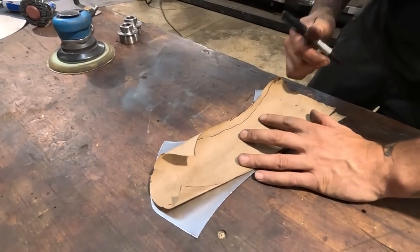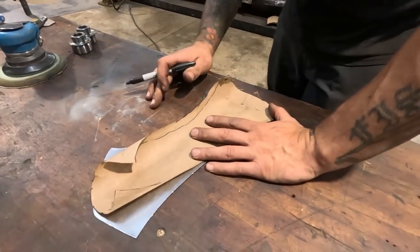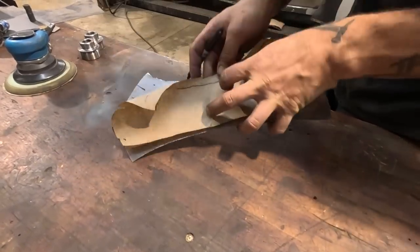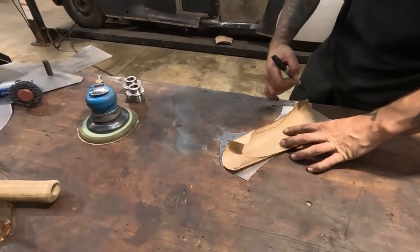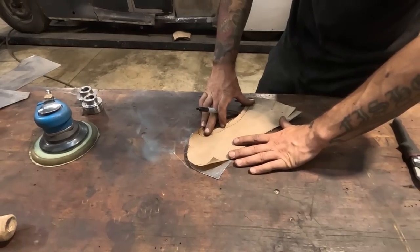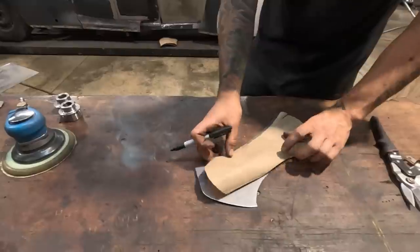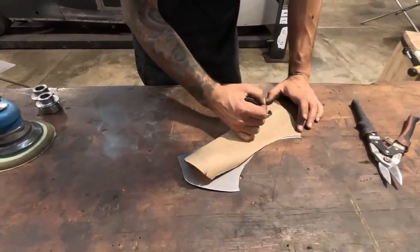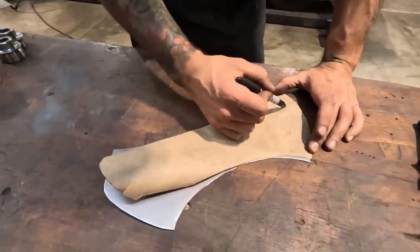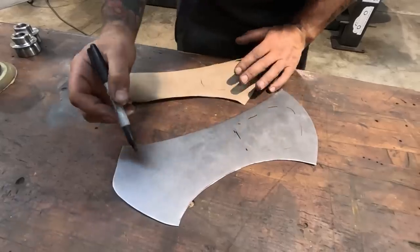This end is where we have these shrinks that we put in, and it kind of took a little bit too much there. And we have to turn it upside down. It's like this when it's on the car, and then it's like this for when we need to see our shrinks. Just making sure. Yeah, definitely. But I guess if we're stretching, we'll be looking at it from the other side as well. This area, I think instead of shrinking this, we will put a couple shrinks with the kick in the side and we'll stretch this area a little bit with the power hammers. So I think here we'll get a little bit of stretch